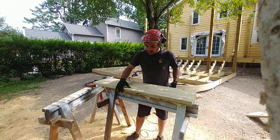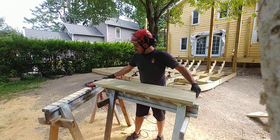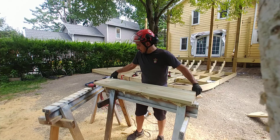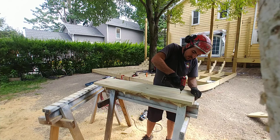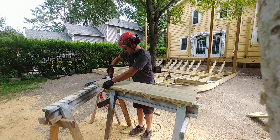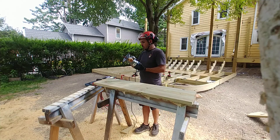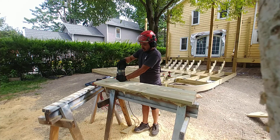This piece has got a bad wainy, chunked-out edge, so we'll send that to the area that's going to be cut away. Every one of these I've justified the end and the back to the pattern itself until I'm feeling good about it. I screw one end down and the other end flush, and then all we've got to do is fire this big router up and let it work its magic — maybe we can burn this bit up right at the last piece, we'll see.